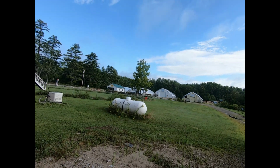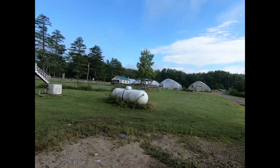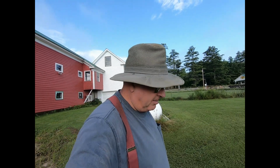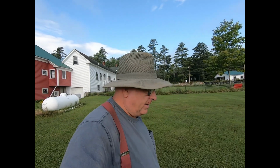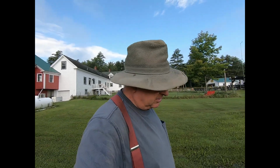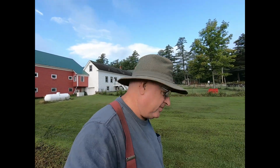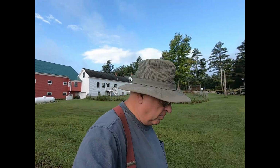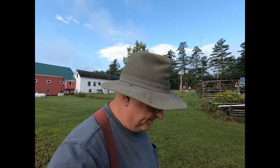So as you can see from here, well, maybe you can with this camera, that second greenhouse is deflated. The little fan, it's a third horsepower, might be a fifth horse. It ain't very big. Anyway, it stalled out yesterday morning. Carol noticed that it was going flat yesterday. So we're going to go on over and pull it off, take it into the shop, see if it's, you know, an oilite bronze, something that we can re-oil and clean, or whether or not needs to be replaced. I'll bring you back here when we get up there.